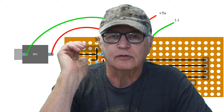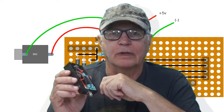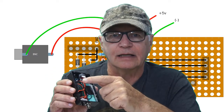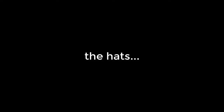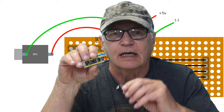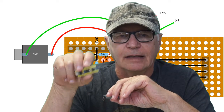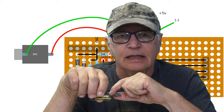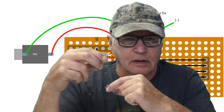I host this circuit on my Google Drive — the link to download it is in the description below. Whenever I have room on a project, as I did in this case, I like the use of headers. The advantage of using the headers is that the STM32 controller board that plugs onto that, or the HC-06 Bluetooth module, can be easily removed if a firmware upgrade becomes available, for example.